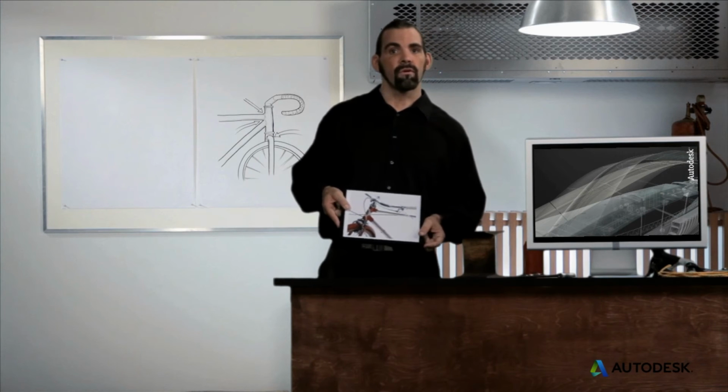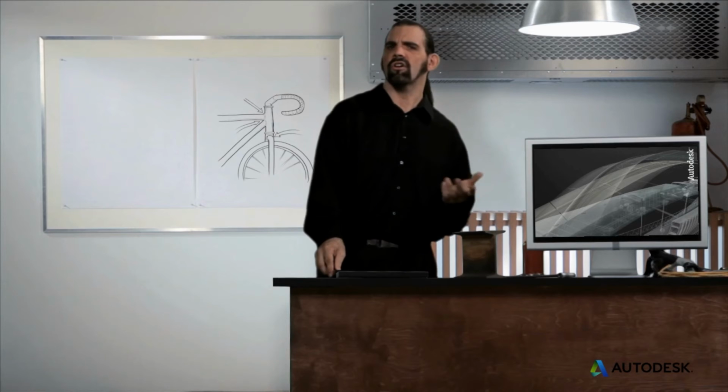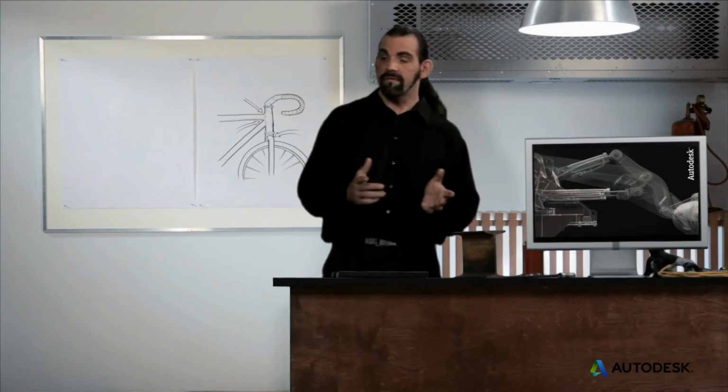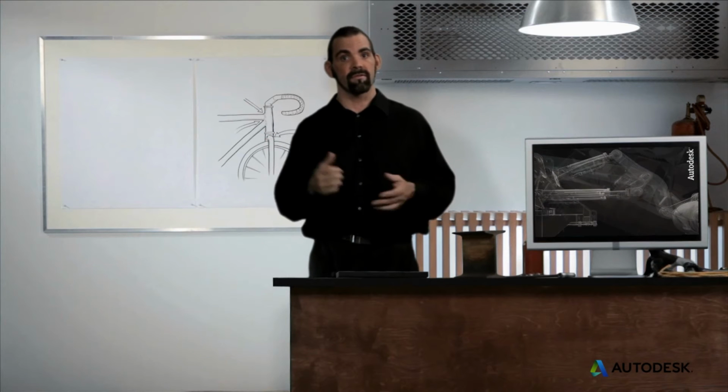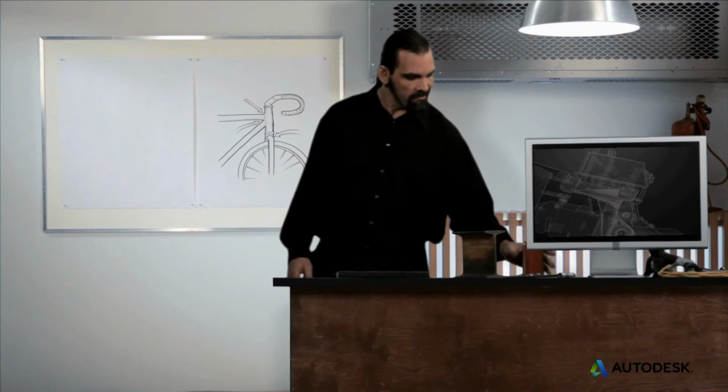With a steel tube frame, you can't round the corners much, so you should reinforce with lugs or thick weld beads. Curves are easy to make with injection molded or forged parts, or even extruded parts in 2 dimensions. They can even be done in sheet metal through processes like hydroforming or deep drawing. This is actually an amazing feat of lightweighting that uses deep drawing to turn a flat metal sheet into a highly optimized curved form.